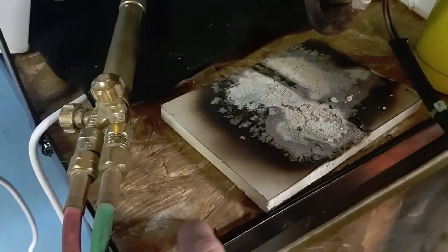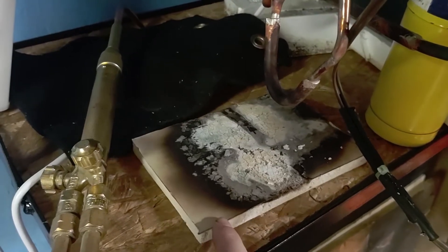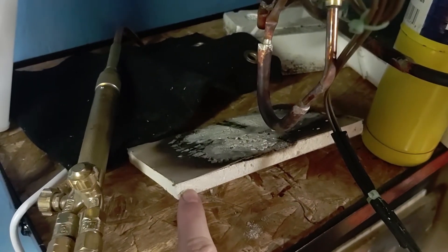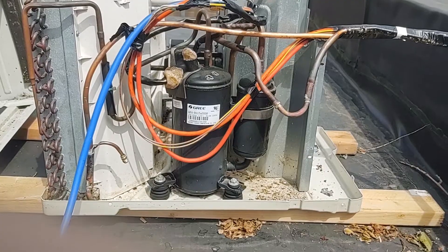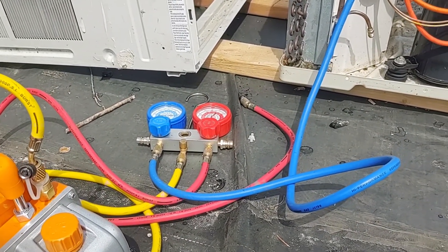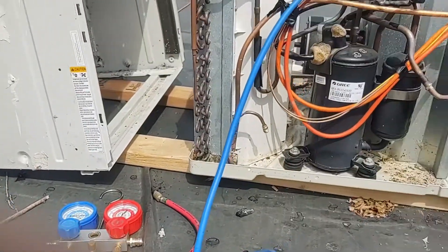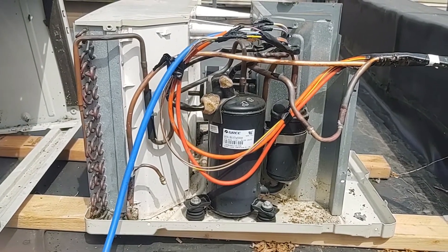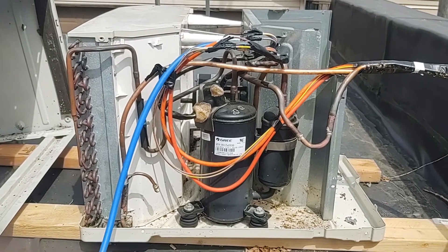I finally also found my solder shields, or heat shields. These are especially good because I'm soldering right next to this piece of wood. Up until now I've just been using a piece of drywall, and those work for a little while but eventually the heat will get to them and they'll fall apart. So I finished soldering all the copper lines and left some nitrogen in the system overnight to test it. Now I'm ready to vacuum the system out of the nitrogen and add some R410A refrigerant back in. After that I'll check the pressures on the R410A with the compressor running, and this should be ready to go.